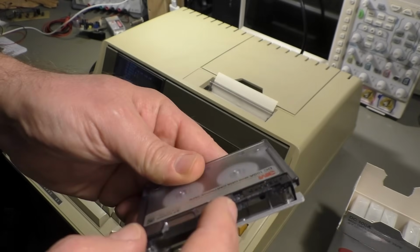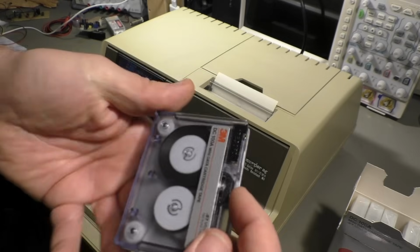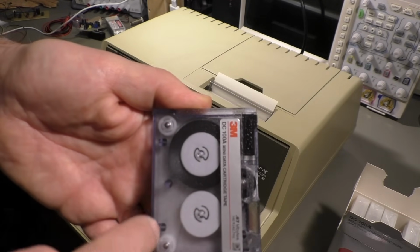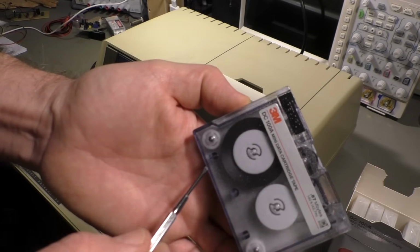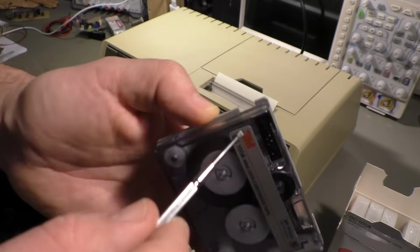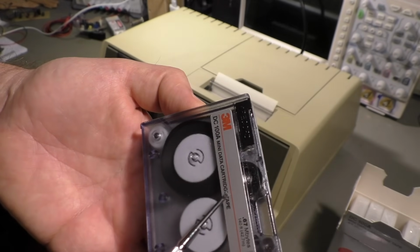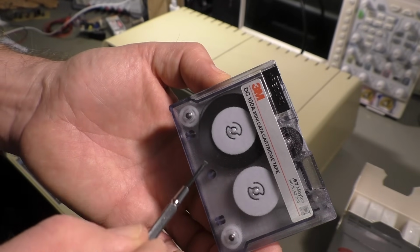Then the tape itself has this little wheel here that is driven by the motor of the HP drive. And you may wonder why the tape wheels here are going around. There is a rubber band going around like this. You can see there are some pulleys here and here. There is also, well, it's probably not a pulley, but a steel post where the tape goes around. Yes, okay. The rubber band that drives the entire mechanism goes around here, goes here, goes back.